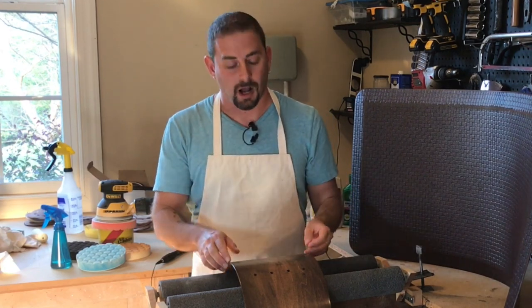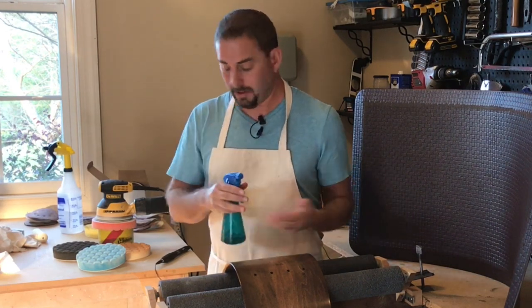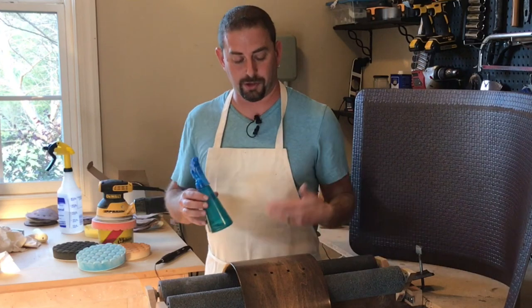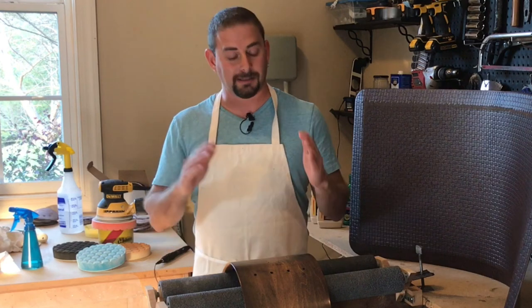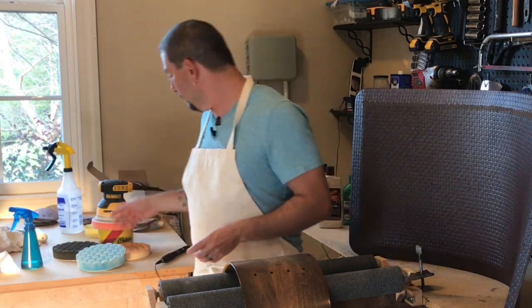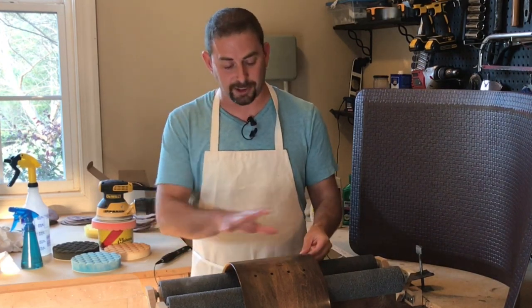Now before I get started, this is super important. I've used an oil-based polyurethane to finish these drums, which means in between coats when I sanded, I used mineral spirits to clean the drums off, wet sand, and whatnot. You have to use mineral spirits because it works with your oil-based stains — you don't want to mix water and oil, it will mess everything up. Trust me, I've done it. However, at this point I've let these drums cure for up to two weeks, so since I'm not planning on adding any more finish, I can now use water. I recommend you wet your pads and wet your surface very lightly — I'm using a little bit of soapy water in a spray bottle. That gives the surface lubrication so you don't scorch or damage the finish.